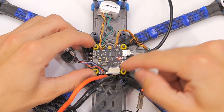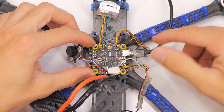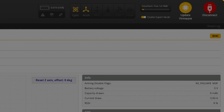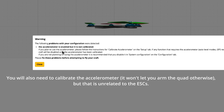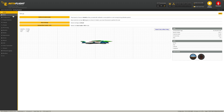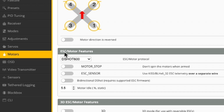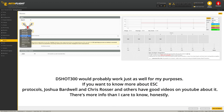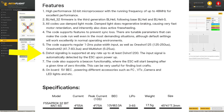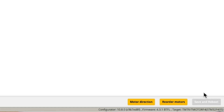We're going to connect our flight controller to Betaflight and get into it. If you are setting this up from a brand new profile, it's going to ask if you want to enable default settings — say yes — and then it will prompt you that your ESC protocol has not been set. To do that, go to the motors tab on the left-hand side. You'll see motor ESC features — it'll probably say disabled at first. Select the protocol you want; in this case we're doing DShot 600, which I found on the T-Motor manufacturer's website for this stack. Once you do that, click save and reboot, then come back to this page.